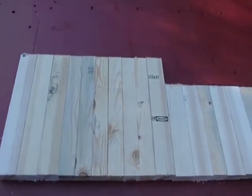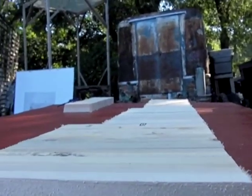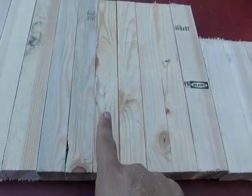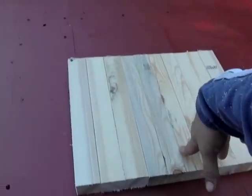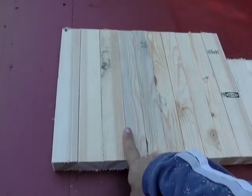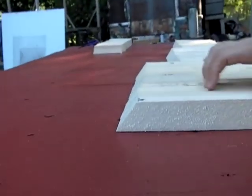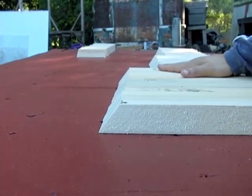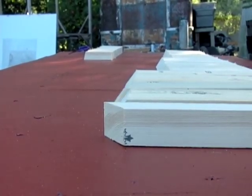Here's where we're at so far. I have 10 of these for each size cut — you can see that they're staggering down. Looking down this way, you'll notice they're all the exact same height; looking this way, this one's narrower and narrower because I used different sizes of scrap wood. When ripping a 2x4 in half, you set the fence to a little less than 1 and 3/4 inches, but that doesn't always give you a perfect center. The 2x4 company makes them the same thickness regardless — they're really good at that — so it's okay if the ripped pieces are a little shorter.